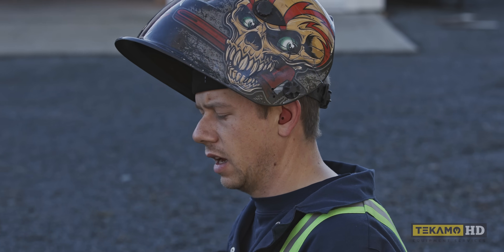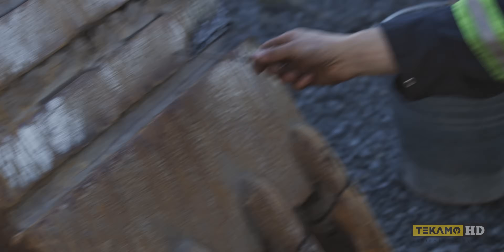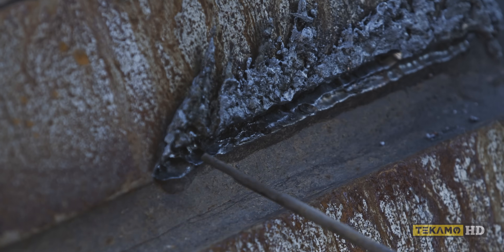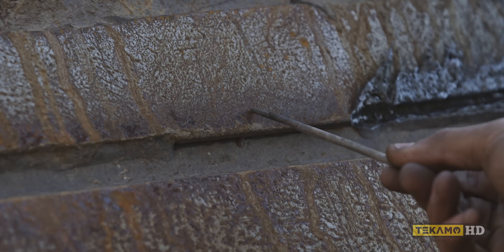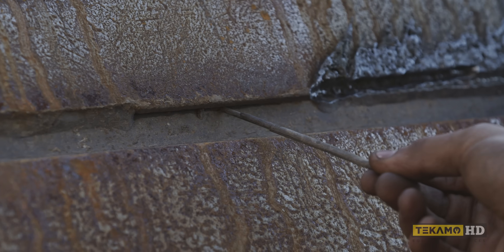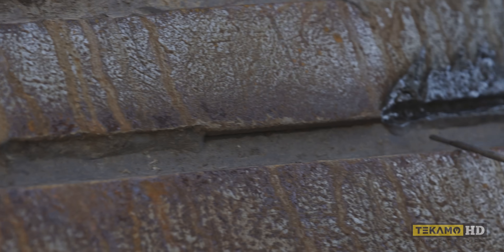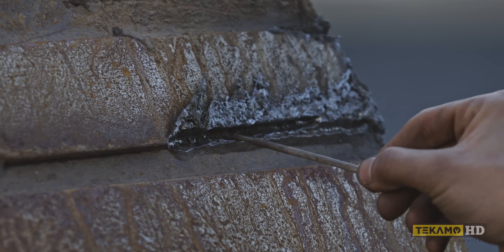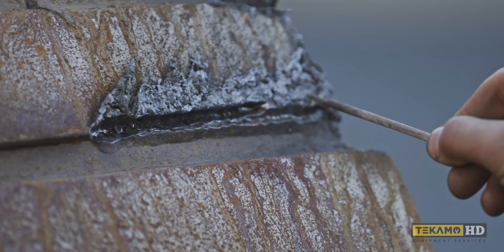When you're gouging you're essentially taking the weld nugget out, and you want to take as little as possible of the parent material — meaning the material you need to save that you're going to reuse. So I try and gouge as much as I can into these bars because these are what we're replacing. You'll never find the seam in a weld right where the corner of the parent material is. The weld nugget always goes past this corner — it's always inside a little bit. So I just gouge past where this backing bar meets the base metal, and then you can see I've started to wash the backing bar away from where the weld is to uncover that seam, and then I just follow it right to the end.